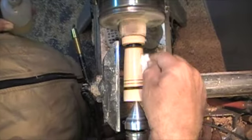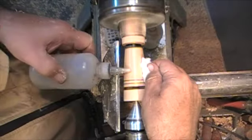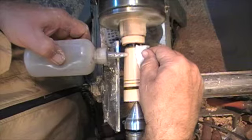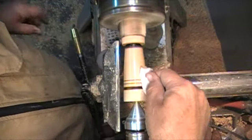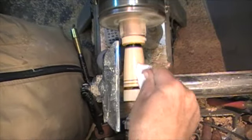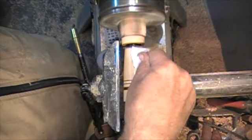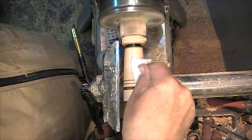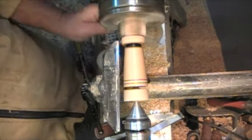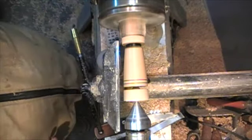This is Deft 50-50. Deft is a lacquer. It's available at Lowe's, Home Depot, and your local hardware store. If you're not in an area where you can find Deft, find a brushing lacquer. Clear. This happens to be the high gloss. I think this piece requires a gloss. I really do. I would build up 3 or 4 coats on this. It may not be all on the machine, but I would get 3 or 4 coats.